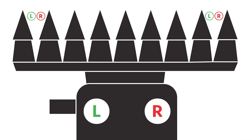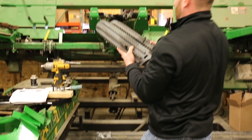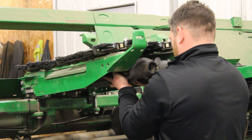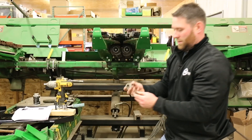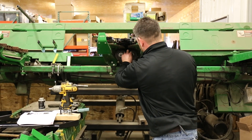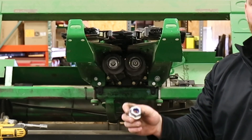From the seat, the right and the left are the same. Line up the timing marks and keep the flutes together — do both at the same time if you can. Shove them on until they seat all the way back. Then take your round washer again with the flat face to the outside, followed by your new M20 flange nuts that come from 360.